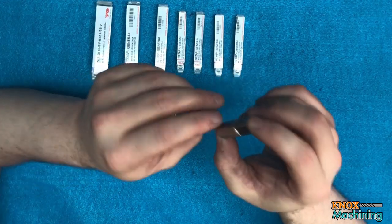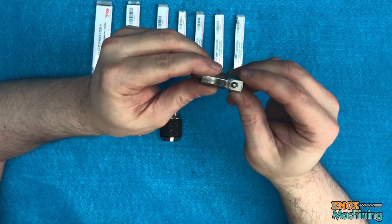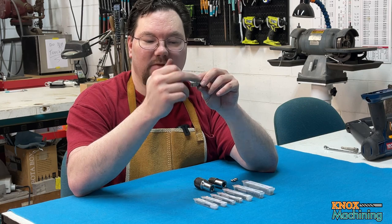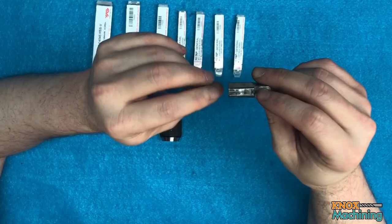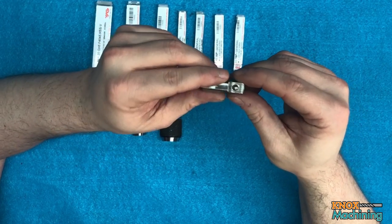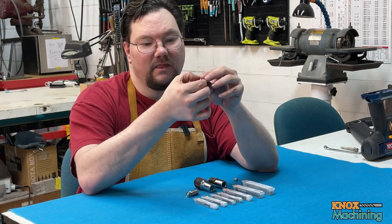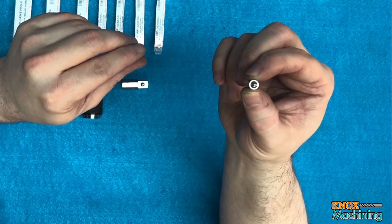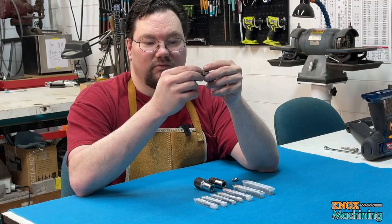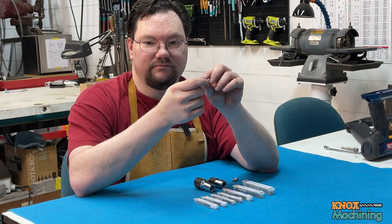I took a piece of half inch round stock, I believe it's cold rolled, and I put it in a 5C collet and collet block, and I milled the four flats, and then I switched it out for the hex collet and milled the six sides for it. Then I drilled and set these little detents that I picked up off of Amazon. I'll put a link to those in the description below also. And made this little adapter. So let's take a look and see how that went.